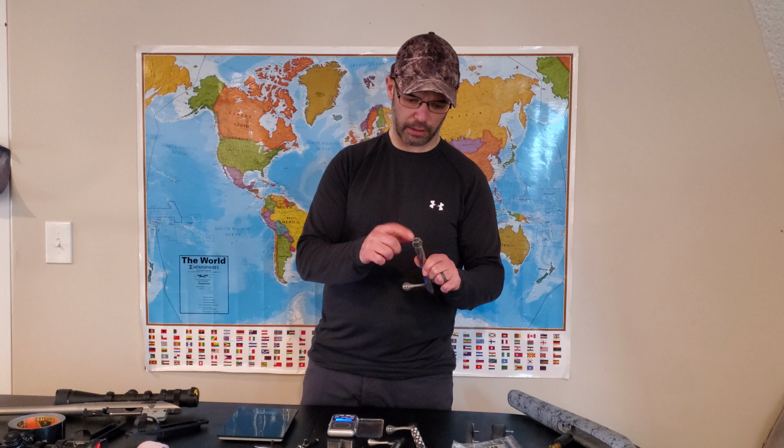8.35 grams, okay? You've got your standard or factory bolt that holds the trigger in place, that bolts the trigger to the action, is a little steel bolt that weighs 6 grams versus the titanium version of that same bolt is 3.18 grams.